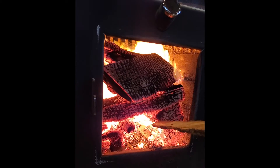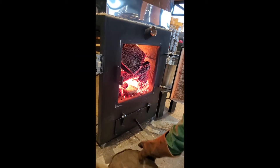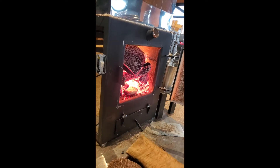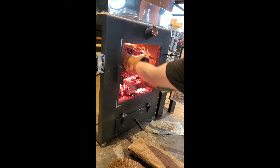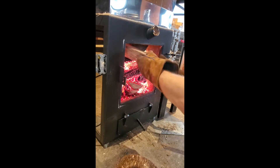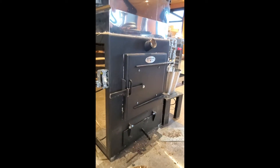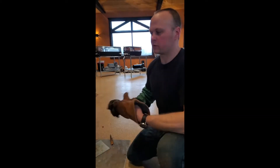I can just tell when this happens. I can tell by the performance of the evaporator. The first thing I'm going to do is just jam that full with wood and get it plugged off to get back to boiling. And while I'm at it, I'm going to top off the firebox. I could tell by the way it was boiling that that firewood cavitated inside the firebox.